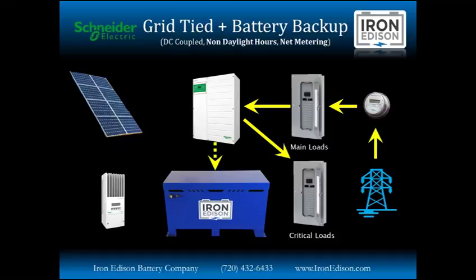Now, during non-daylight hours, we see the grid return, but the battery may be low because it's nighttime. So what we see in this situation is that the grid is coming in, feeding the main load panel, feeding all the appliances in the house. The inverter will pass through the grid power to keep the critical loads online and powered up. Optionally, we'll see the inverter start to charge the battery if required and get that battery ready for another potential grid outage.